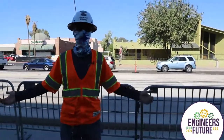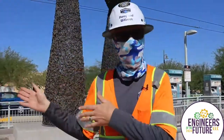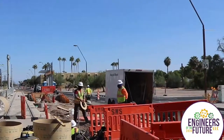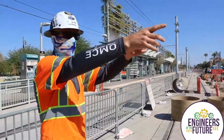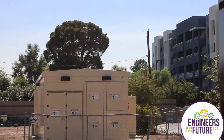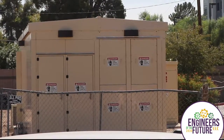Right here is where the streetcar can get onto the streetcar tracks and the light rail tracks using points and switches that divert the train from one track to the other. There's also a little bit of tail track at the end, which means a little bit of excess track so they can store an extra vehicle in case there's an issue. Through here is also where everything comes together - across the street you can see traction power substation TPSS number three in this empty lot. This is the communication and power hub of the project; all the conduit runs underground out to the track and into the duct bank, which also feeds the overhead OCS poles.